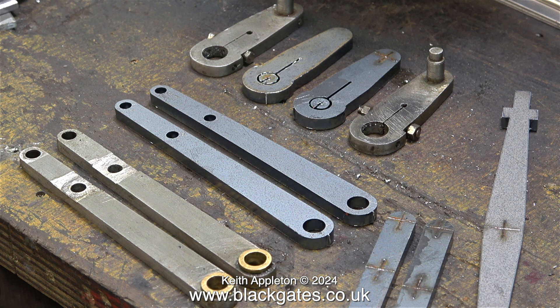The vibrating levers are diabolical. Although they are important parts, these particular ones are so badly made I just can't use them. It looks like the bushes — which by the way are not in the centre — are made from brass, and that is a big no-no. I am aware that a lot of models are made from brass, some of them good and some not so good, but when you get up to this scale you cannot use brass as a bearing material.